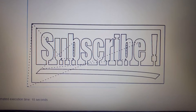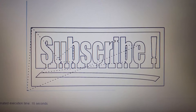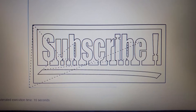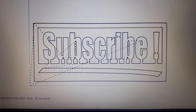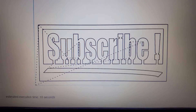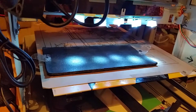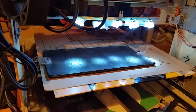The paths — the Inkscape plugin did a pretty good job at optimizing them. Really it's a box with what would normally be a concentric box, but we've broken up that outline to contain the individual letters using the little bridges. I'm going to send that to the laser plotter. I've got a piece of black Depron or black meat tray foam ready to get that burnt on, and I'm just going to send that file now.